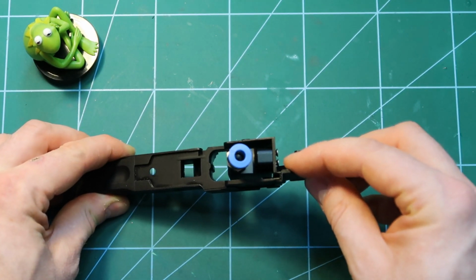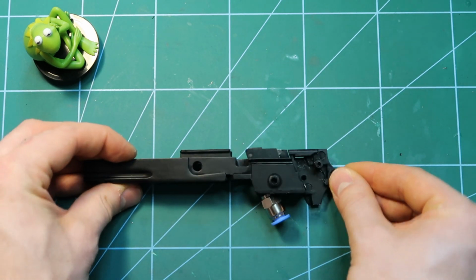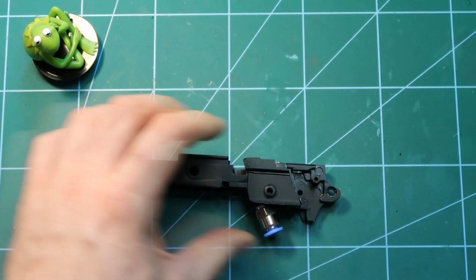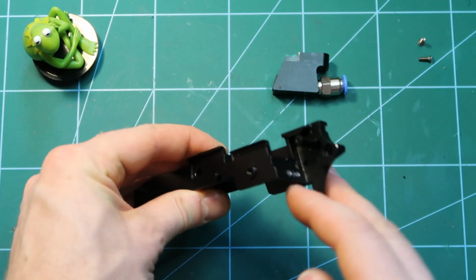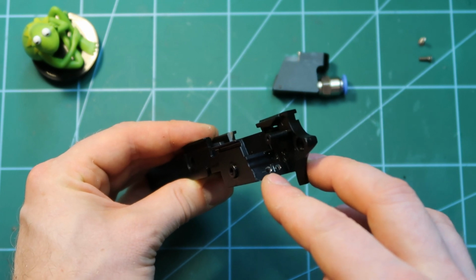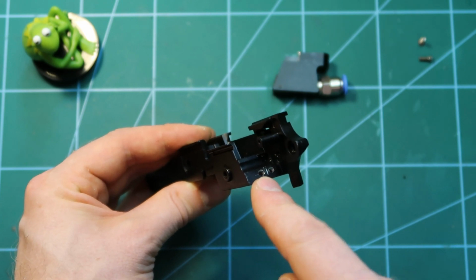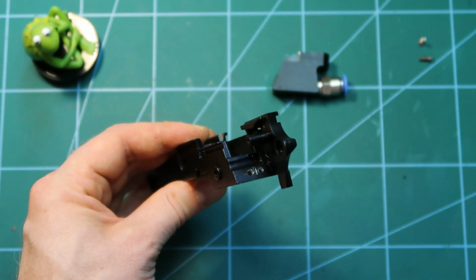We need to do one more thing, because right now the heads of the screws are sticking out, and there is a mechanism sliding just above this wall, so there would not be space for it right now. So we need to make a conical opening at the beginning of the screw holes, big enough to hide the heads of the screws. So what we need to do is to just remove those, put the conversion aside for one more moment, and the screw head is more or less 4.5 millimeters in diameter. So we need to take something like maybe a 5 millimeter drill, or some chamfering tool, and we need to center on these holes and add a chamfer big enough that at the tip it has the size of the head of the screw, so that the screw head will sit flush with this wall. I will do it off screen and I will show you how it looks when ready.